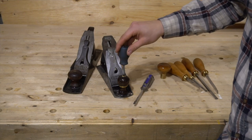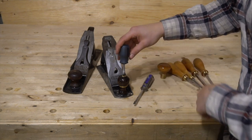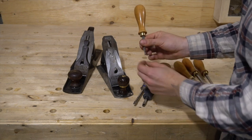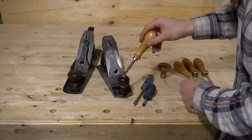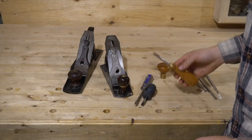And when you put them in, it tends to put pressure only at the top of the fastener, and that can have really bad effects because it can actually damage the screws when you're turning them. So I designed these screwdrivers, which are what you call hollow ground screwdrivers. So it doesn't taper here; it stays not tapered, and it's just as wide as the fastener. So I can easily mount this here, unscrew them, all I want to do, and it doesn't damage them whatsoever.